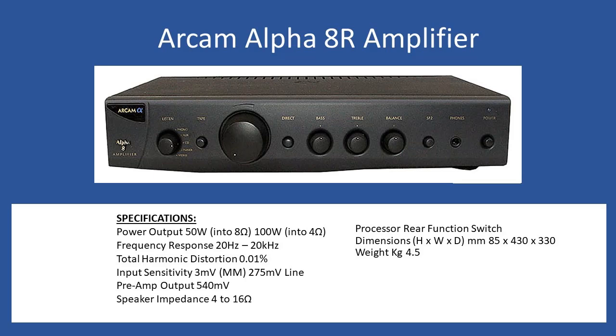On the front fascia there is a headphone socket, which is a quarter-inch jack. On the rear there are two sets of speaker terminals — SP1 and SP2. One set is switched and one is unswitched. Switched means that connecting headphones will disconnect the rear speakers; unswitched means it will not.